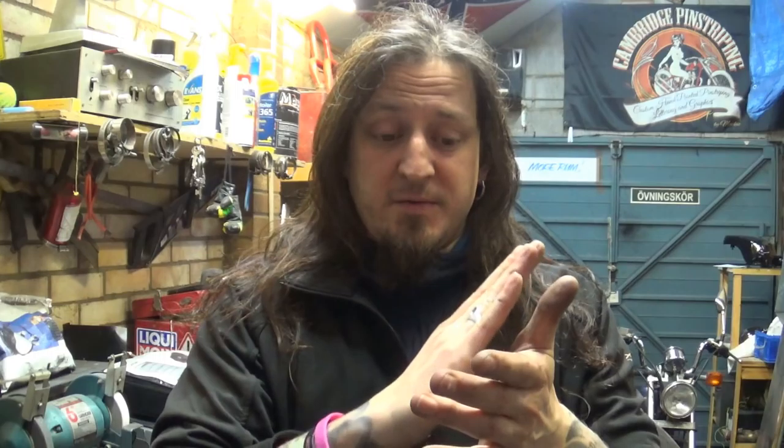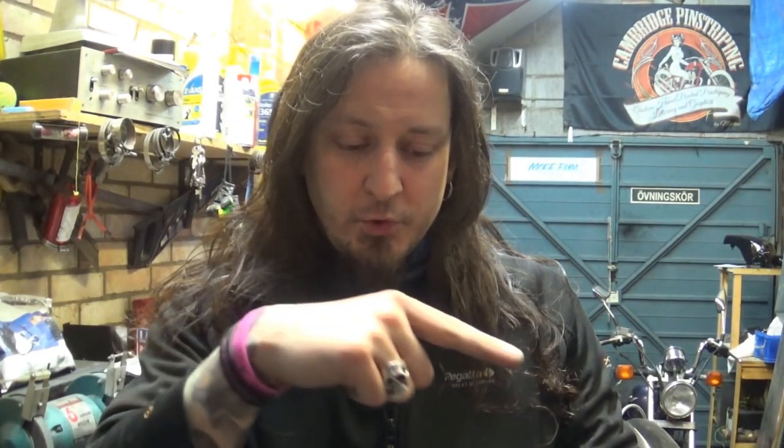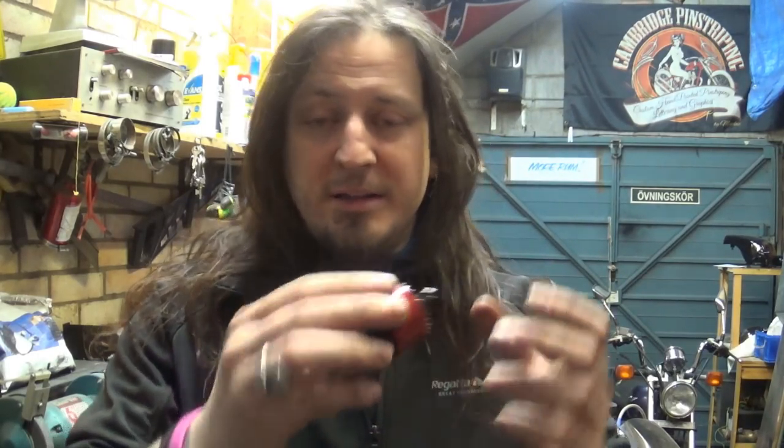There are a couple of options I've got. One is an angle grinder. I can just notch a triangle piece out of a tube and then finesse it with a flap disc, or I can use a hole saw and create some kind of jig and see where that takes me, because I can just cut through the tube directly, one and the other side, or maybe straight through, and that should also give me good enough results.